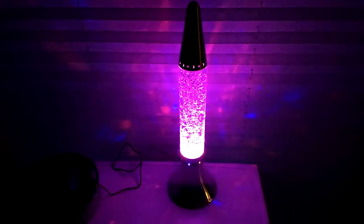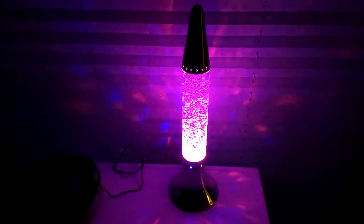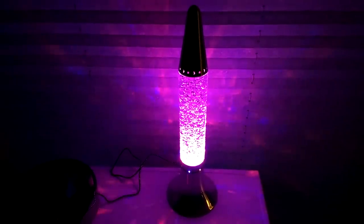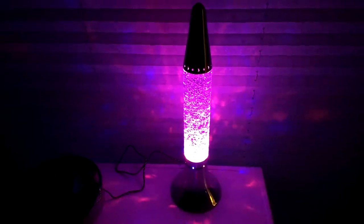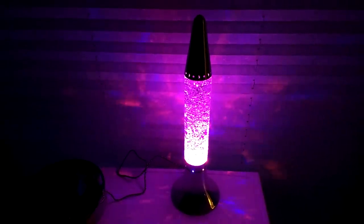The movement in the liquid is very good for such a low power, mainly because in traditional glitter lamps, the lamp is not directly connected to the bottle. In this case, the resistor is directly connected to the bottle and therefore dissipates the heat directly into the liquid. So what you see is the thermal dissipation from that resistor interpreted as fluid flow.